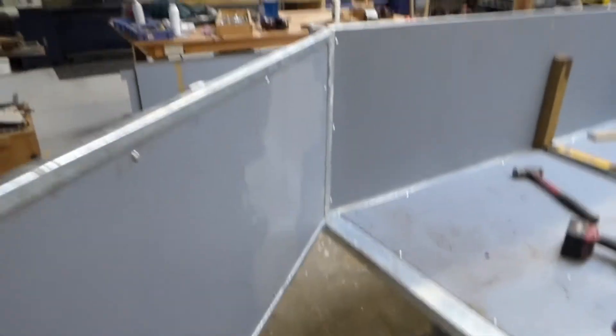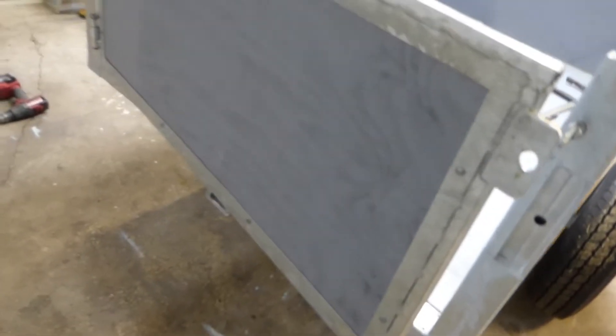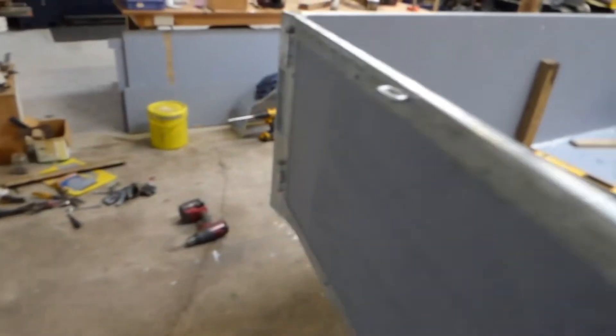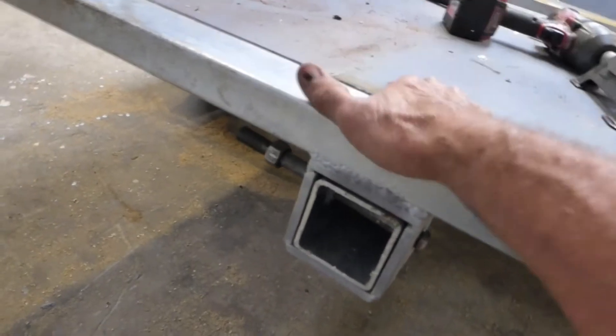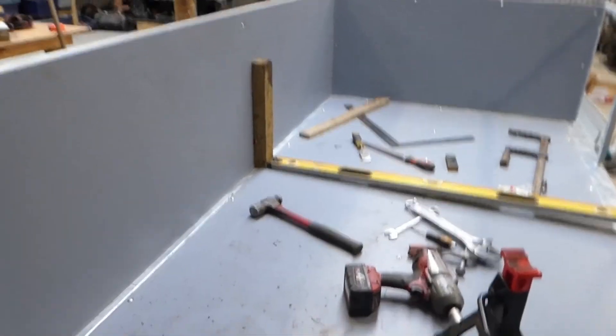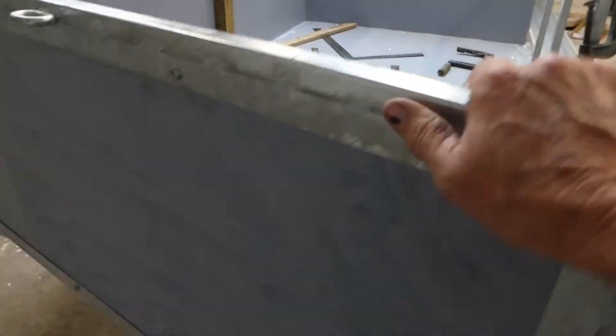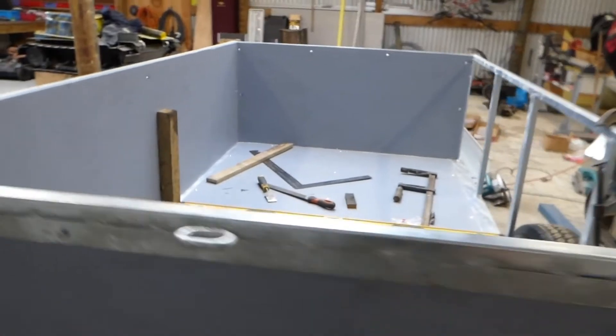Got the back door in — I like these swing doors. If you loan the trailer out, someone doesn't undo the door and flop it on the ground and bend your hinges. It's a bit tight. When I went to the galvanizers, this beam at the back got bowed down, and I spent quite a long time — I put a big pile of timber up here and wrapped a two-ton chain block around and cranked it up to try and pull these sides back up. The back has to fit flush with the bottom of that steel there, so you can put big high heavy loads across the top without wrecking anything.